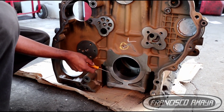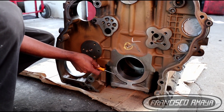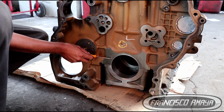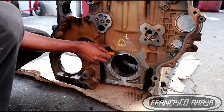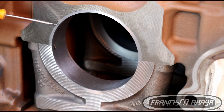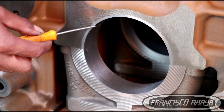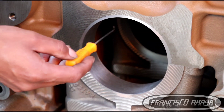In the case of the cap — this is the main cap right here — you can buy a new or used cap in good condition and put it on; that is not a problem. But in the case of the engine block, you cannot do that. You have to cut it, cut it all the way. You can see how deep it is cut, and that is where the insert goes, filling up the metal that was removed so we can get back the tolerance needed to install the new crankshaft.